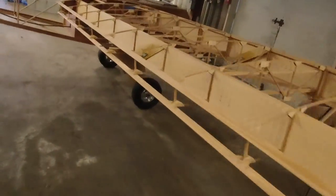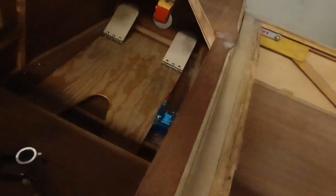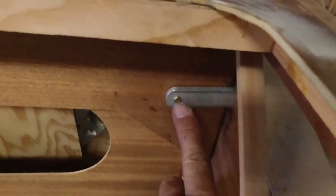As you saw, we got all of this done. We got the bolt through there and through the backside here. Once the wing comes off, like I said, this gets drilled out for a 3/8 bushing through the wood there that'll get epoxied in place. And everything worked out super good, right? Oh yeah. Great. And I hope you enjoyed the footage of Parker upside down inside your plane.